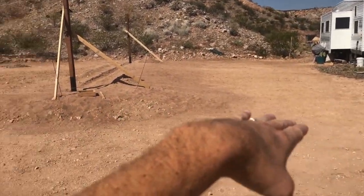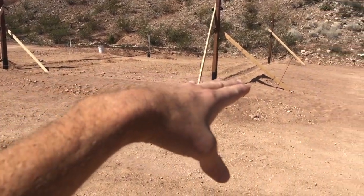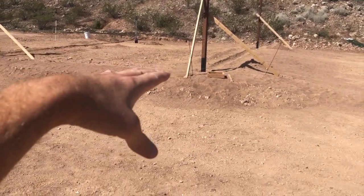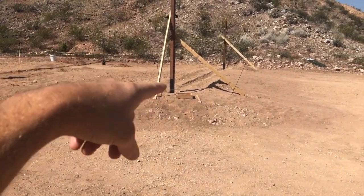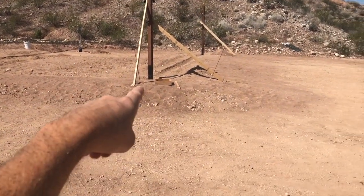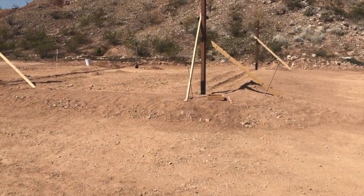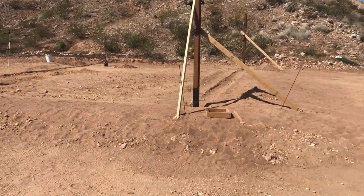That means I have to ramp off the front and kind of slowly grade into the back, so it flattens out in here but it's not perfect — the ground undulates a little bit with rocks and little bumps. The problem with that is if I want every post to be two feet in the ground, I can't just dig down two feet from the exact level of the ground where I dig the post, because maybe over here the ground is a couple inches higher or lower. So I'm trying to be very exact, and the only way to do that is you cannot trust the ground.